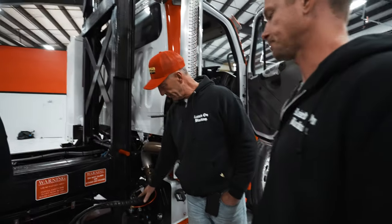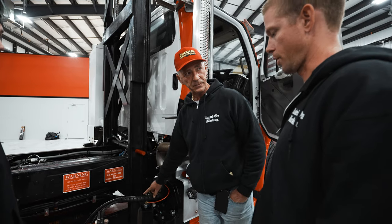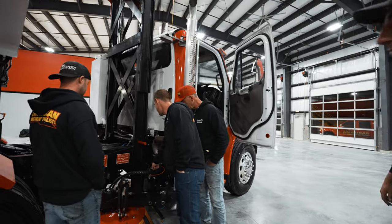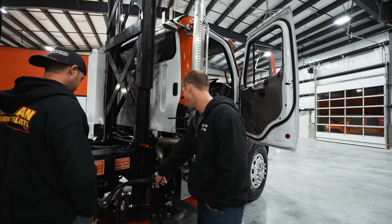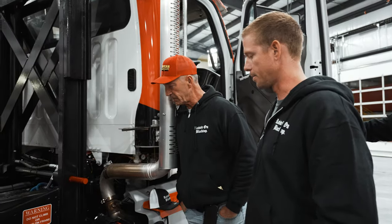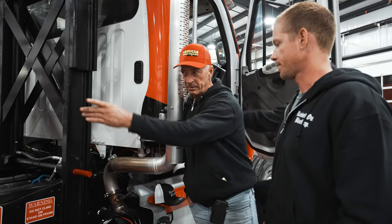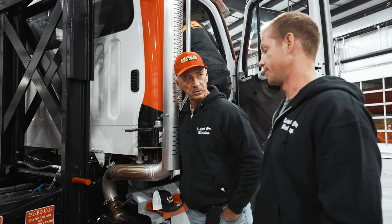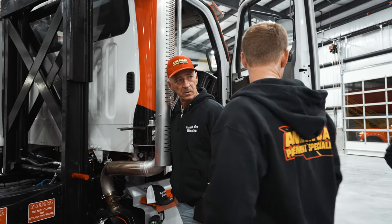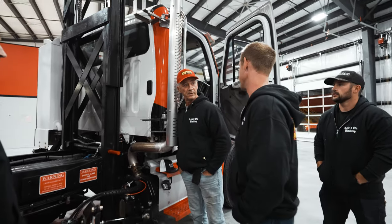So these are operated in and out and up and down by air and spin hydraulically? Correct. Yeah, so a three-stage cylinder for in and out, and then up and down is the airbag there, and then, yeah, the rotation is hydraulic. Yep, Parker hydraulic motor. And how wide is it, once you're all the way open in the back, how wide a pass do you sweep in one shot? With the new three position, it's like 170 inches or something ridiculous like that. Really? Yeah, they're very wide.